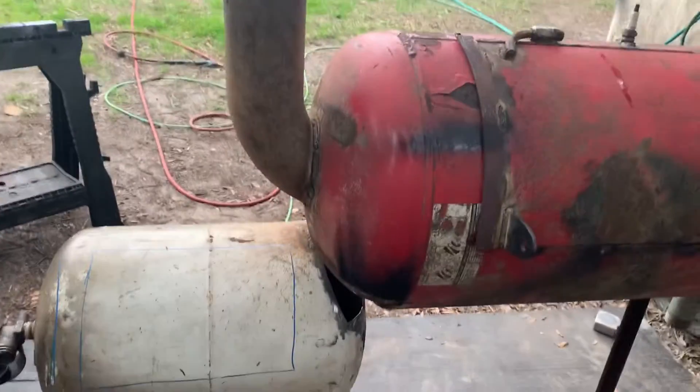They fit just like so. The next step now is to cut these doors. What I like to do — what I did on the top and what seems to work best — is cut the actual spot where the hinge is going to go, then weld on your hinge so that way your door in theory should close back to how it is now, instead of trying to line everything back up afterward. That's what I should have done to begin with on this one, but I didn't and it got a little lopsided.